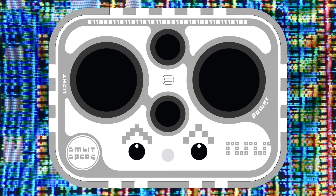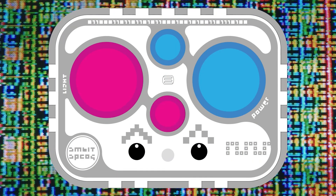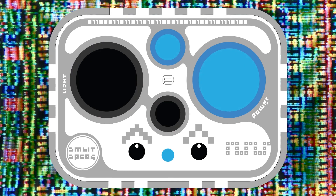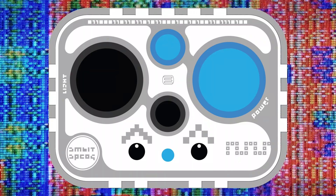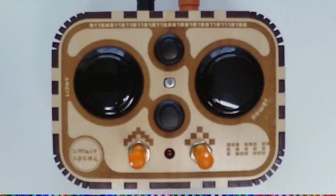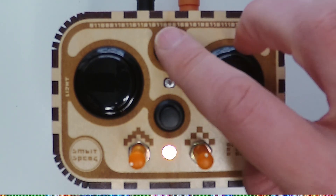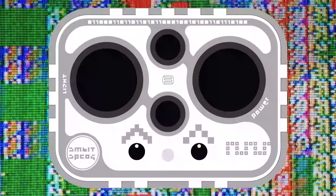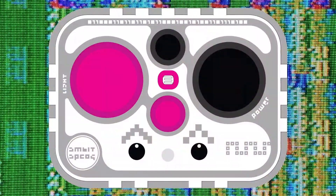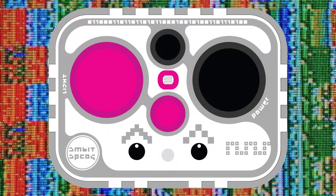On the top of the APC there are two arcade buttons, each with a smaller latching button, associated by the graphic outlines on the case. The arcade button on the right temporarily turns on the power, while the latching power button turns the power on indefinitely. The arcade button on the left temporarily turns on the light sensor, while the latching button turns on the light sensor indefinitely.